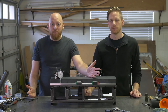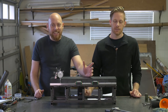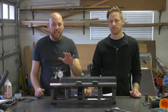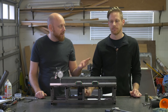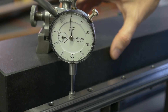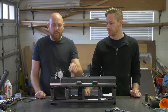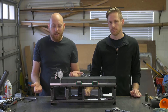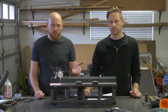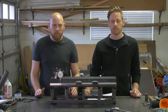First axis is done. Let's talk a little bit about tolerances. We're shooting for really a half a thou tolerance on everything. Why did we choose a half a thou? A couple of reasons: the easiest one is my surface gauge is a little bit wobbly — it's within about half a thousandth. And the thinnest shim stock we could find was half a thou. Honestly, for any application we're planning on doing with this thing, especially this small surface grinder, half a thou is going to be plenty good enough.